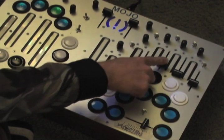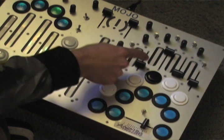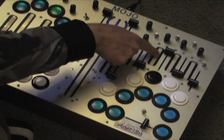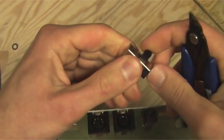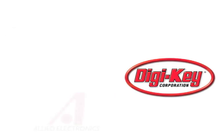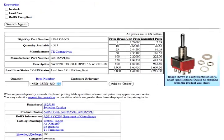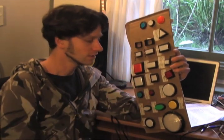There are lots of different kinds of sensors out there. The Mojo has pretty basic sensors: faders, knobs, momentary buttons, toggle switches, and touch strips. Even after you decide what kinds of sensors you're going to use, you still have to decide which particular model you want. You can hack sensors out of premade controllers, or you can order new ones from electronics catalogs. Most catalogs have literally thousands of different models of switches alone. I narrowed down my choices by looking at the specs online, then ordering up one of each I thought might be right for me. I hand tested literally hundreds of different sensors to find the right ones for the Mojo. Try some out, and I'm sure you'll find the right ones for you.